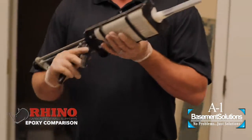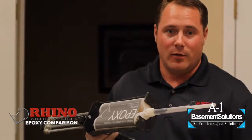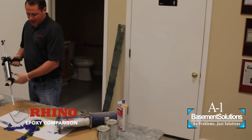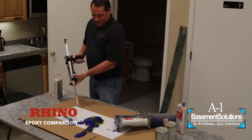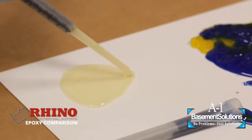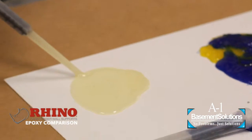It's nice and easy — you can see the gun is nice and easy to work with. You can imagine holding a very heavy gun up trying to apply 15 or 20 carbon fiber straps; you better have been working out the day before. This epoxy you barely have to squeeze, it comes out nice and easy. As it comes down through here, it's mixing it perfectly so you don't have to worry about that. It comes out nice and fluid, nice and clear — you can see how that will very easily penetrate right into the block, taking it back half inch to three-quarters of an inch and holding the block together, making it stronger.